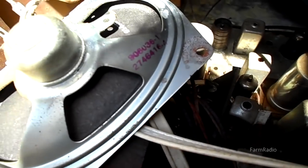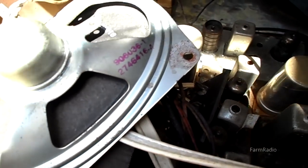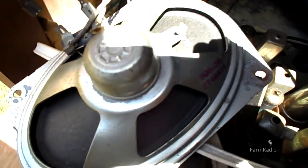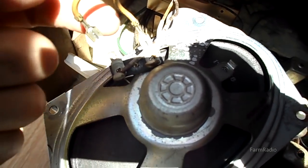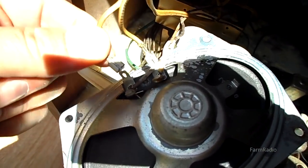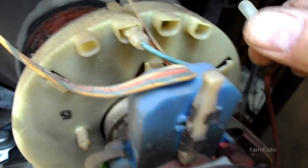This actually looks like an RCA speaker — I believe that's an RCA part number. That may mean the 16th week of '64 — that's why the rivet popped. Just taking a note: the dotted black goes to the white, and the brown goes to the plain, and this goes to the other speaker on the opposite side of the cabinet. I'm going to go ahead and remove the yoke connection.